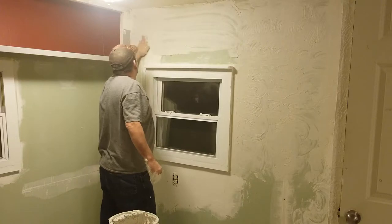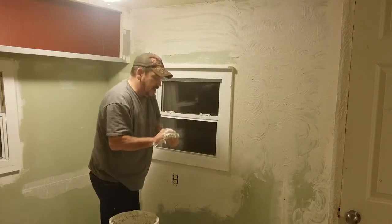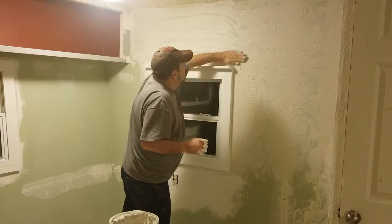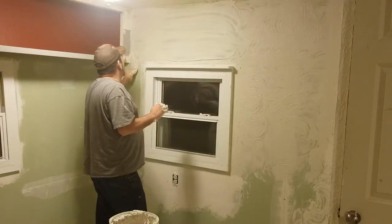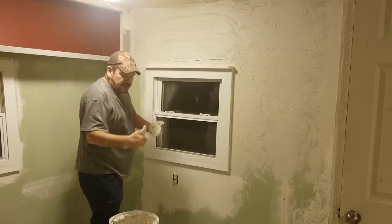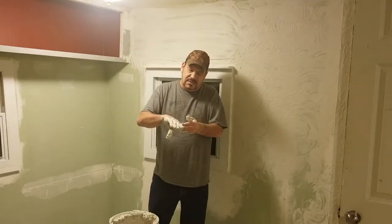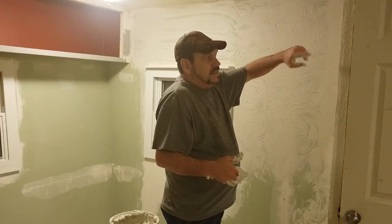If it's raining outside or there's a lot of moisture in the air, it's going to take a little longer to dry. But being this thin, it really does dry fast. To go back over the seams, they've been done about 30 minutes ago. Let it dry overnight before you try to paint it. At the least, texture in the morning and paint at night or late in the evening. But I always wait until the next day — this is a day old and it's plenty ready.